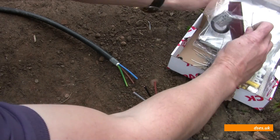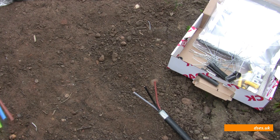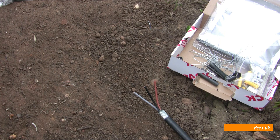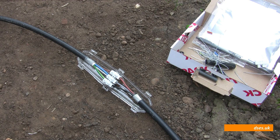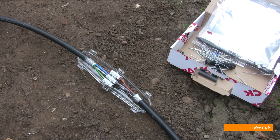Just use the sandpaper to clean up our SWA strands. That one's all right but this one's just looking a bit fruity. I've wired up the SWA — apologies if I'm being a bit succinct, my battery's running low on the camcorder. As you can see, I've connected up the wires and it's all within the footprint of the outer case. I wouldn't ordinarily use screw connectors on what I consider to be a maintenance-free junction. This probably doesn't come under BS5733, but it still comes under the relevant regulation, which says it's fine to have connections in an enclosure that's made for the job.